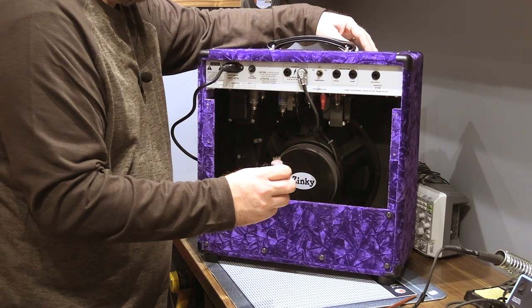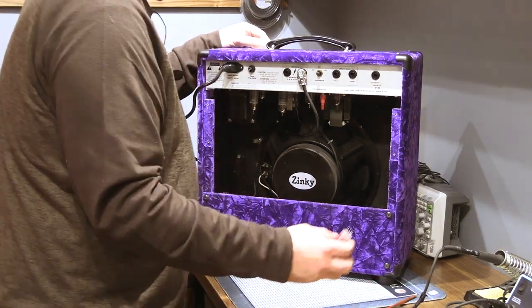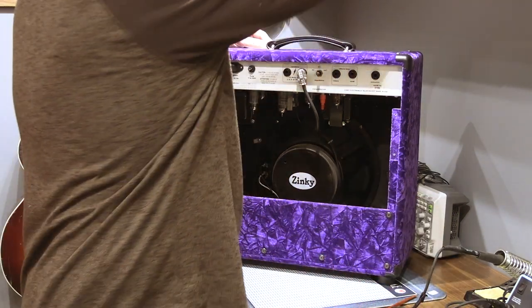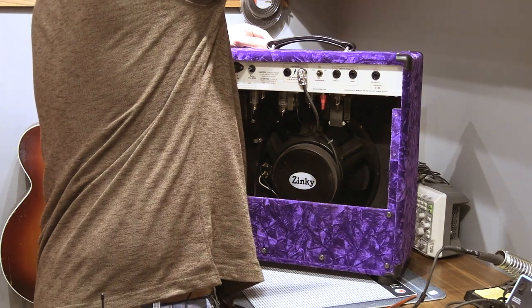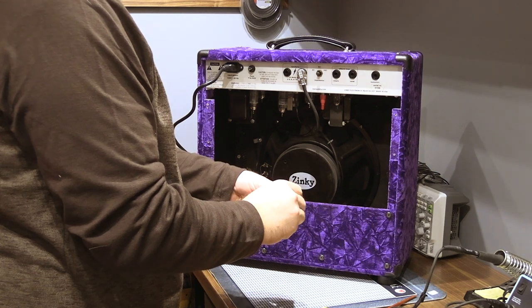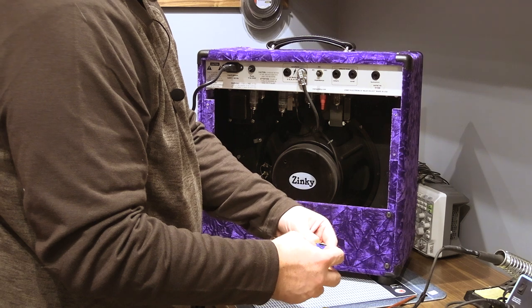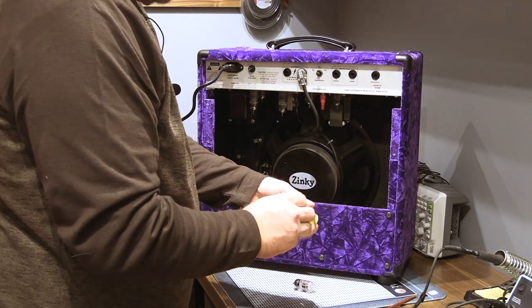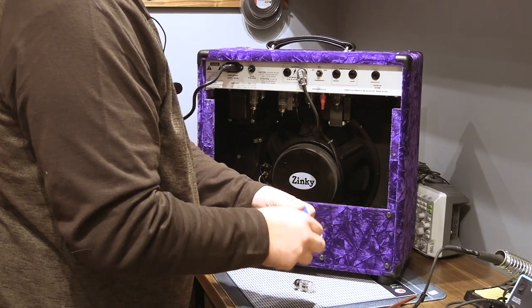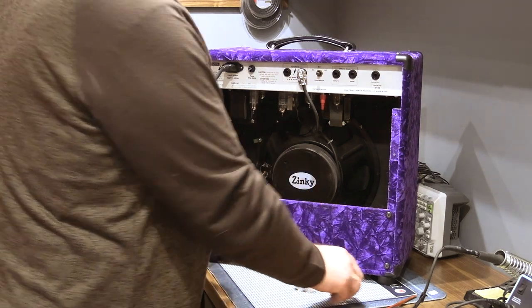Noise is gone. All right, so this was V1, we thought was super microphonic. V2, super noisy. So let's look at a couple of new JJs, pop these in here and see what we have. I'm hopeful, since popping that second tube out made the noise go away. I've had brand new tubes in the box not be any good, so I'm never surprised. When I buy tubes, I really should sit down and test them and never assume.